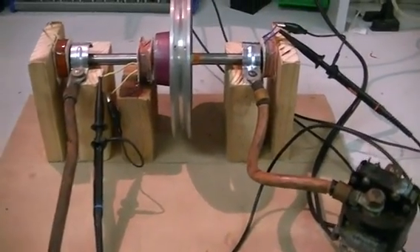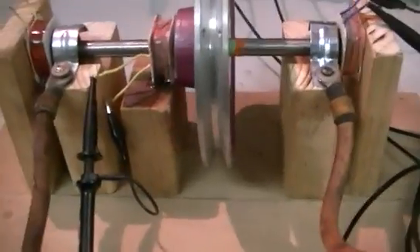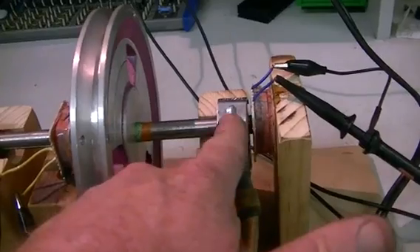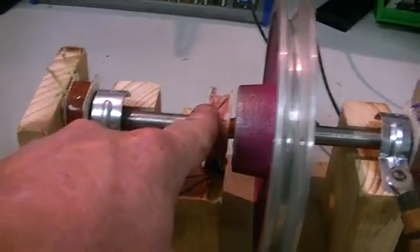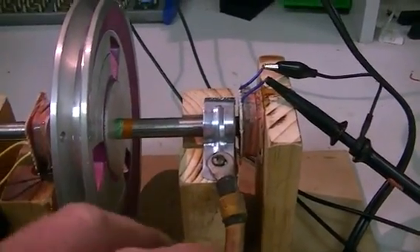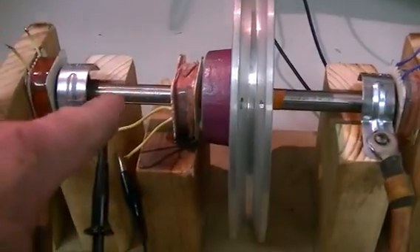Here's our first little setup of our bearing motor. It seems to have a shaft bearing under each one of these caps. What I've done is put a field detection coil here and one at each end of the bearings. I've only got two channels on my scope, so we're going to be looking at this one here and this one here.